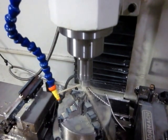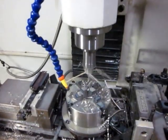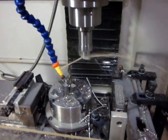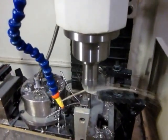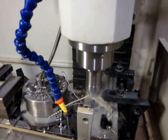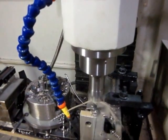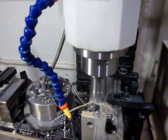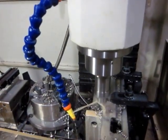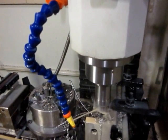I'll come back and highlight each tool as it goes. The drill is about 1.1 inches deep. I used a cobalt drill knowing it would probably give me a little more tool life. Things are a little squeaky — I don't mind that, the doors are shut and the neighbors are not complaining. As long as my tool life isn't hurt by the chatter. I'm just using a regular drill cycle here — it was a quick way to program it. Back-dragging the tool is probably not helping my tool life, but I'll watch to see if that becomes a problem.